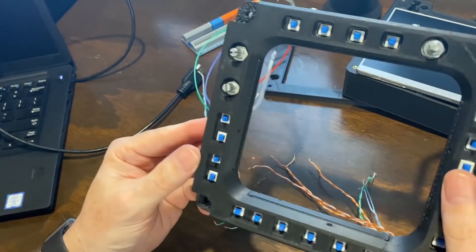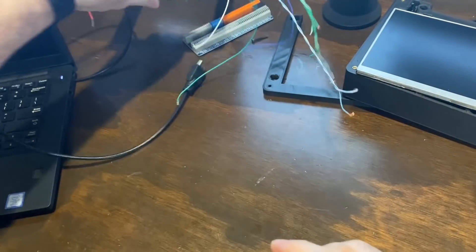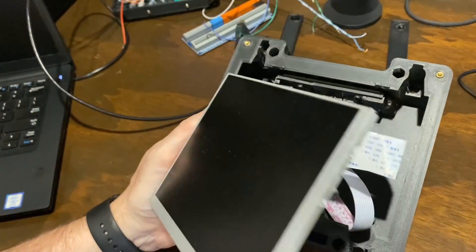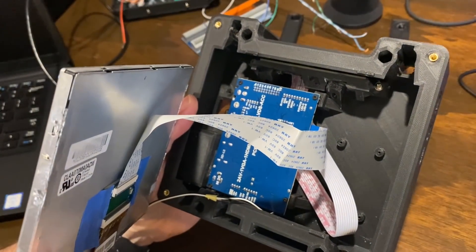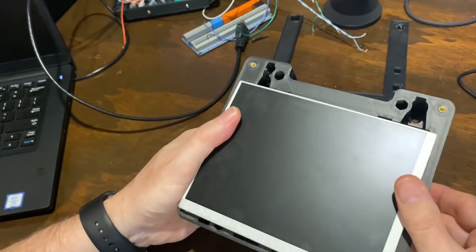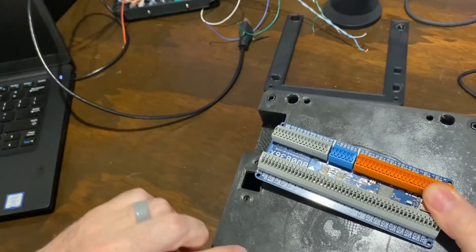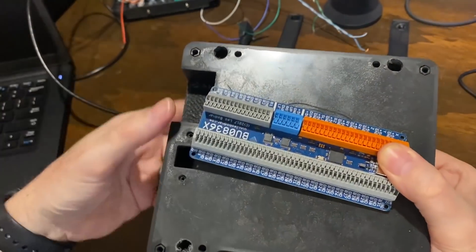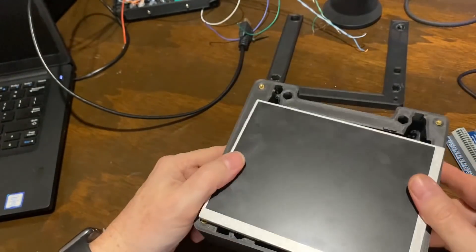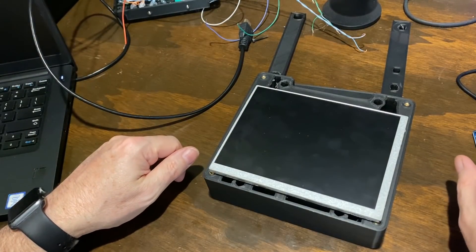So that's where I'm at right now. Next step will be to get all this buttoned up and wired together. I think the original design intended for the wiring to all be done underneath, but I think there's just too much stuff in there — it's going to be a giant disaster. So what I'm going to do is mount the Leo Bodnar board to the back, have the wires come completely out through the holes I drilled, connect to that board, and have it permanently mounted. I'll also need to come up with some sort of design to mount the whole contraption and the grips to.